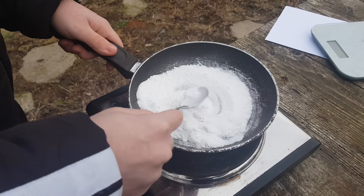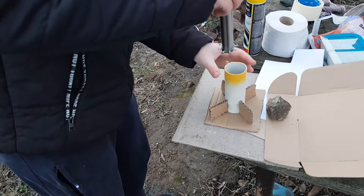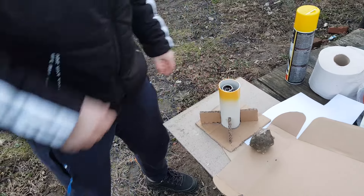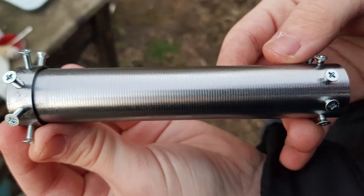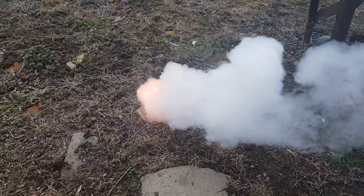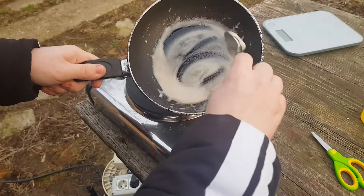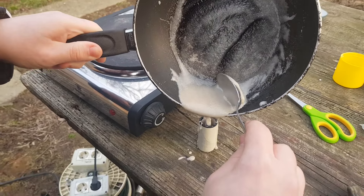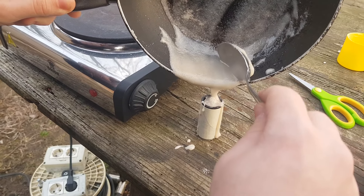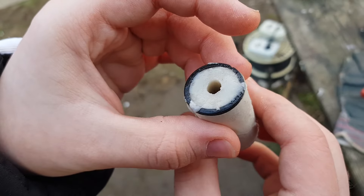I was feeling very optimistic about this second trial. This time I was going to go prepared — I brought a scale, I made a test stand, I was going to film with two phones at daytime, and I made upgrades to the propellant casting equipment. If everything went to plan, the average thrust should be about 40 N so I should read about 4 kg on the scale. I made a test batch of propellant containing only sorbitol and potassium nitrate. Seeing how well that burned, I decided to remove the sugar from the final mixture, thinking it would create viscosity issues when pouring the propellant into the molds. When I saw how well the new propellant poured into the molds, I knew the grains would be fine. Indeed, after the sorbitol solidified, the propellant grains looked perfect. The only thing left now was to assemble the engine.